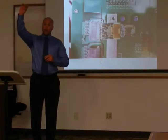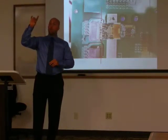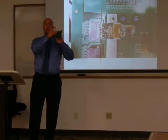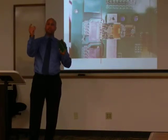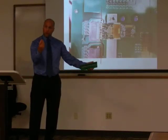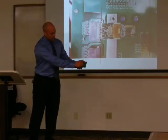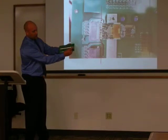So you hold it by the edge, and put your finger behind so it doesn't roll. If you don't put that finger back there, it will roll when you try to insert it. When your finger rolls, you're mashing wire bonds, and you just destroy the part. So you hold the burn-in board, you hold your part, finger behind, starting from slot 1, and you slide the part in.